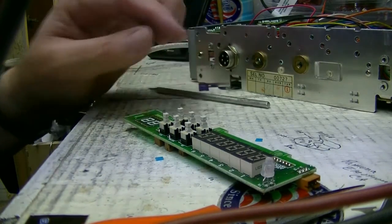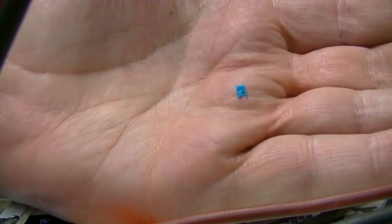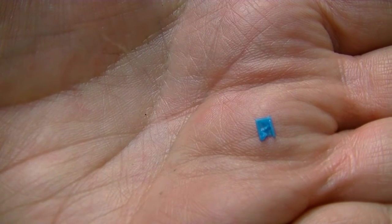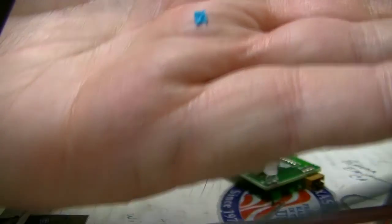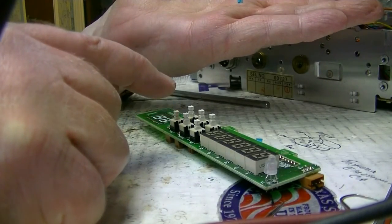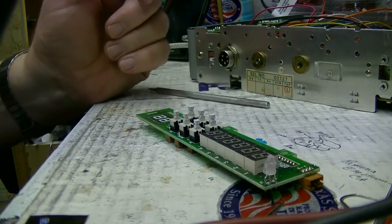Let me hold that where you can see the groove in it. Ended up pretty close to the camera — maybe the camera will refocus. Yeah, you can see the groove in there now. That's what you want to get out. Sharp tools make it easy. Just remember to hold that shaft down. Once you turn that loose, you might as well replace the switch.